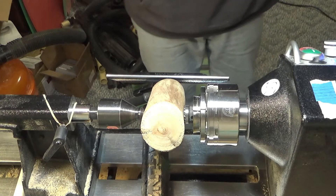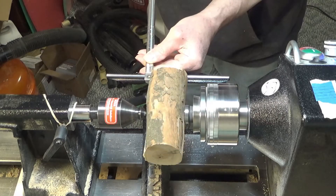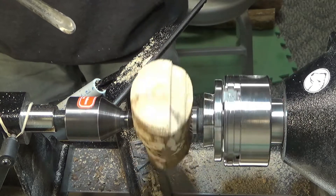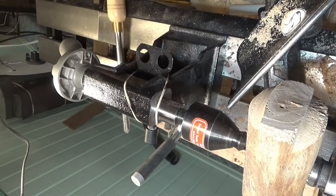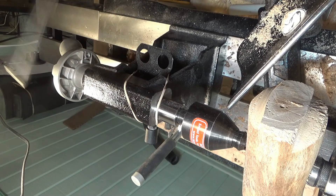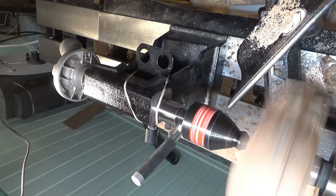This may not make it onto film. I'm coming at it from this side with the gouge — just the bowl gouge. I think you're upside down and everything, and my helmet's going to be hitting the camera. In case you're wondering, this is not a spindle, it's a bowl. The grain is running perpendicular to the axis of the lathe, so it's just ordinary bowl cutting.